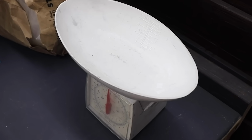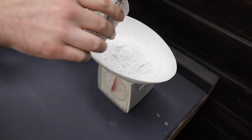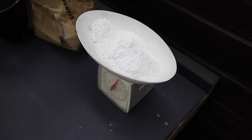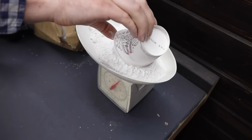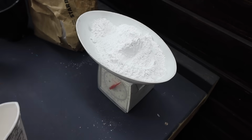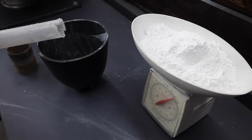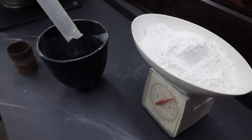It's now time to invest these wax models. I'm using a 3-inch flask, so the measurement of powder to water is a very specific one. I use a small scale and slowly add powder to it until I get the weight desired. I'll then add the water into the mixing bowl. I've found that it works best to add the powder to the water rather than the other way around. It just mixes better.